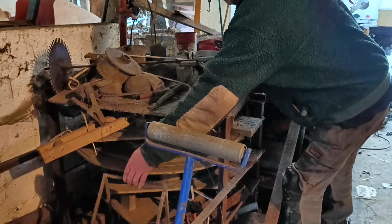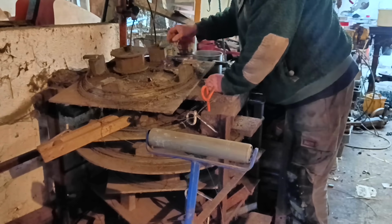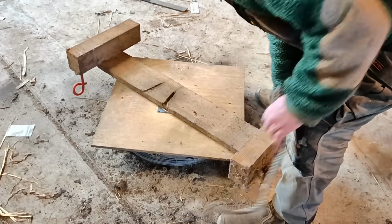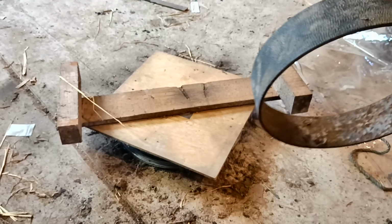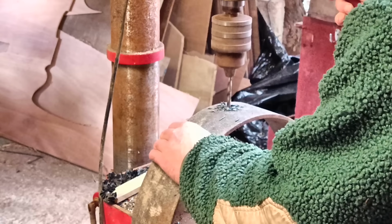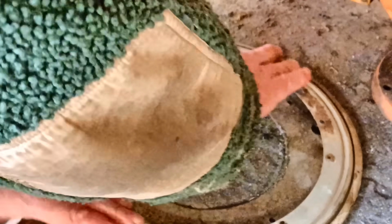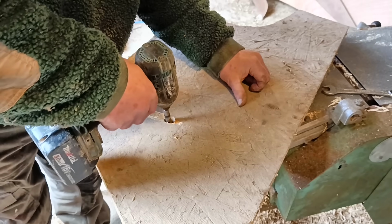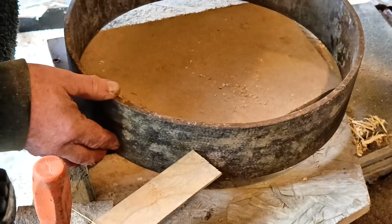So I dismantled an old machine that I'd made so I could borrow one of the Lazy Susan bearings inside. This is the pipe that I want to cut. It's 8mm thick and top quality seamless steel, but this piece is just too wide, so it's a good piece to experiment with. I drilled a hole in it because plasma cutters prefer to start from an edge rather than piercing through a blank face. Then I set it up so it spins without much oscillation.